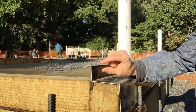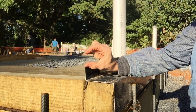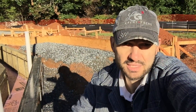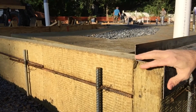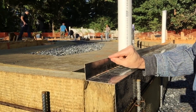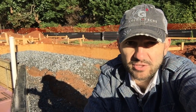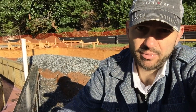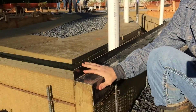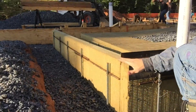This little lip here will be flashed to the slab or to the building. The slab here is going to be poured right flush to here — this is the transition between our garage and our back porch slab and the interior slab. Where this butts into the foundation, the slab will just be poured right up to this level, and where that meets the building, we're going to do some continuous liquid flashing. In this project, we're using all PolyWall products, their Blue Barrier system, and we're going to use one of their tape products, which we'll talk about in a later video. This is how we're transitioning between inside the conditioned building and the unconditioned portion — the back porch and the garage.